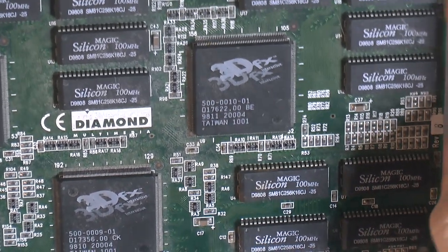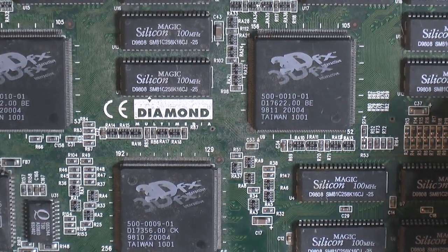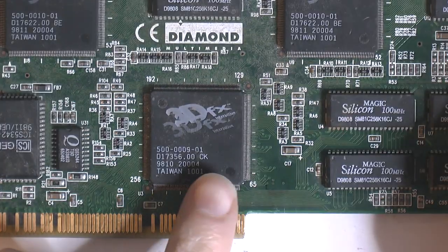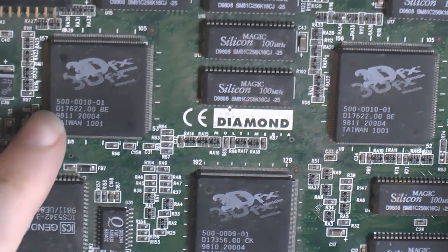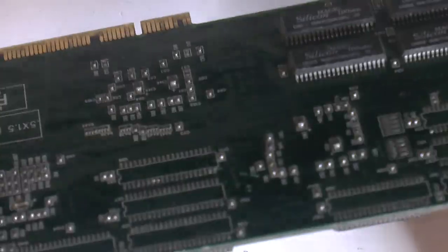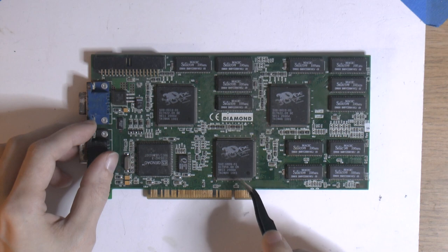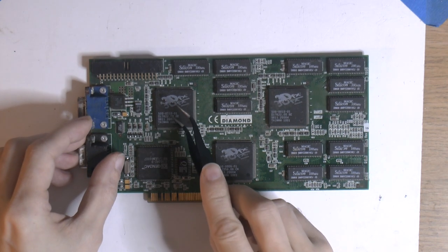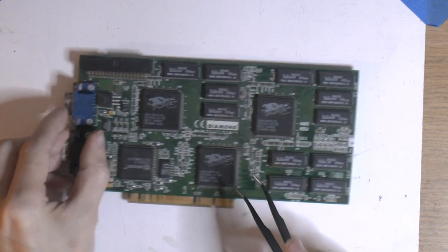So the PCB on this might be good, but it's not straight, so it could maybe be used to populate with some new chips. Because it has a decently well-preserved FBI chip and one TMU, it was my first candidate, but then I realized the PCB is in quite bad shape. So my plan is actually to try to straighten out the pins on the FBI chip here, make sure this is one that's also good, and remove those. Use for another card,